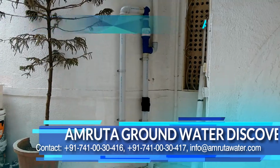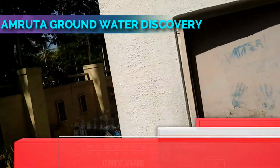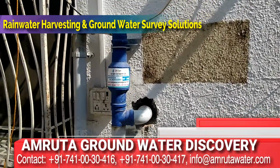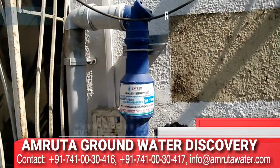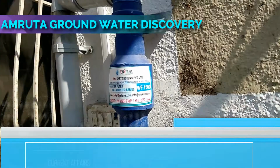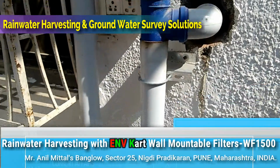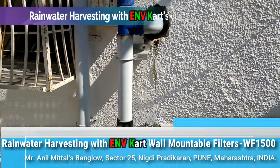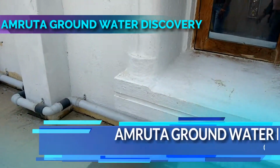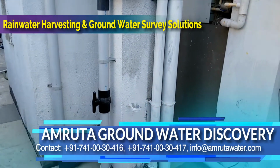I'll walk you through the second rainwater harvesting filter implementation, and this pipe is at the backside of the building. You can see the ENV Kart Systems wall-mounted series WF-1500 has been installed here, and this downtake pipe is coming from here. We have redirected it to the first flush beneath the filter, and that's where the first flush pipe is. The pipeline is getting joined to the third rainwater harvesting filter, the wall-mounted filter WF-1500.